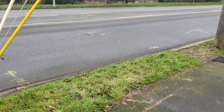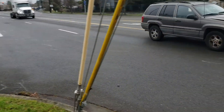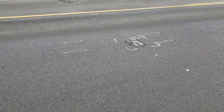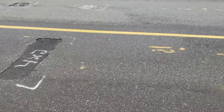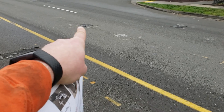I think we could do the two by two and the sidewalk with traffic control coming this way — arrow board, bump them over. Then open this back up and hit this four by two in the turn lane, and put the arrow board right here shifting people over to the right. That could get the four by two and the two by two.